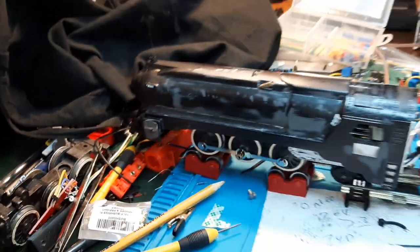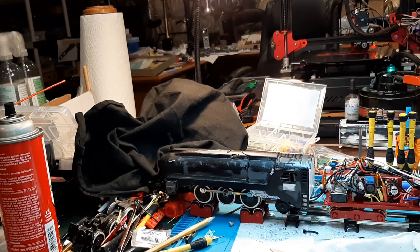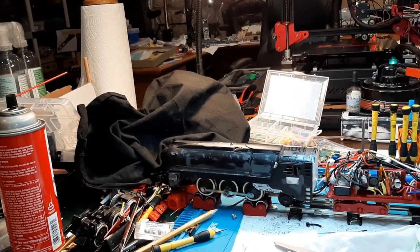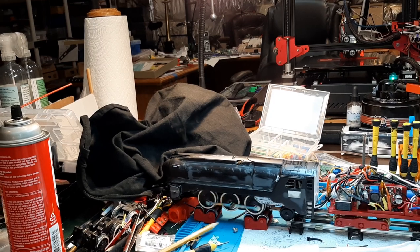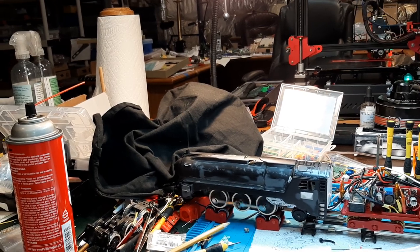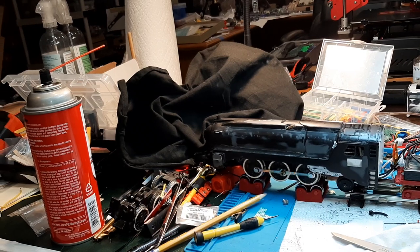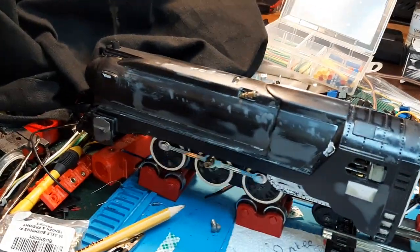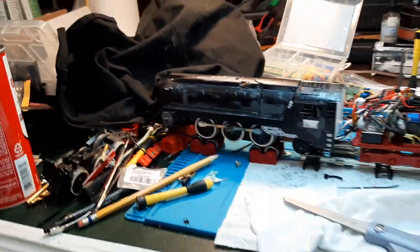Well now, I just said it and it didn't pulse — that's forward and that's beautiful. I was almost ready to say it was the capacitor on the relay trigger circuit, but now I'm not so sure. Both of those get hot; I don't like it, but that's the way they are — they operate that way.